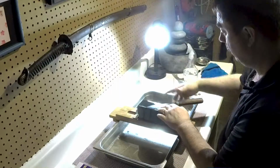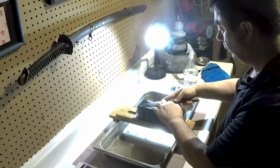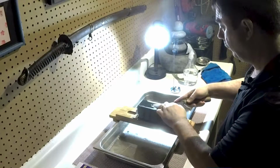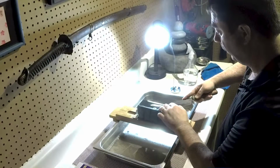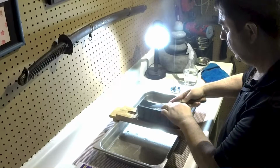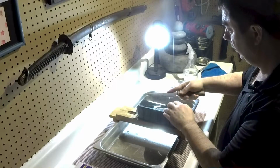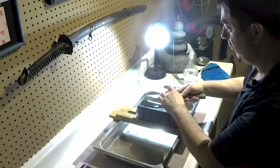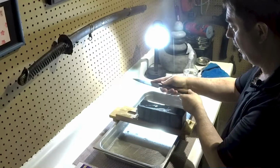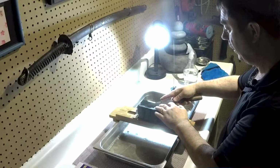All I'm doing, literally, I'll hold it down, get my edge, pressure is when I go up. I release it coming back. Lifting up the elbow on the tip, not by much, and back down for this. Your wrist should be part of your arm. It should never move. It shouldn't rotate. You shouldn't get this, because that's what gives you the unsteadiness. That's what changes your angle, right? Your wrist should be locked in. Literally, if you can lock it in, pinch grip like this on your knife, I prefer a little bit up, these smaller knives, right, like that. Roll it, hold it, and keep it there.